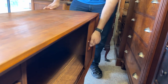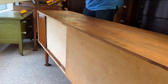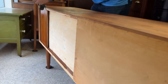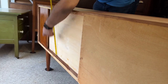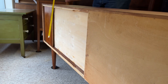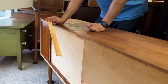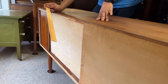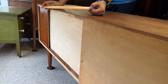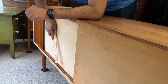So I'm going to show the back again. I need something to replace the clamp. I measured the gap — from here to here — and that was about 18 and 1/16 of an inch. I need something a little bit bigger to push the panels apart. Home Depot has these paint stirring sticks — they're solid pine. I had a few extras from another project. I measured a little above 18 and 1/16, went one notch above, cut it short, and put it right here.